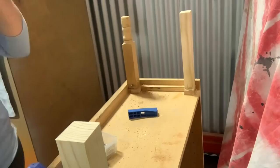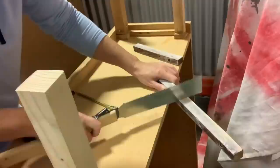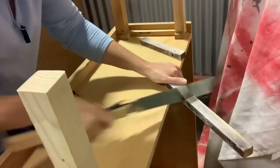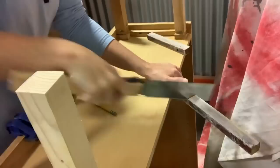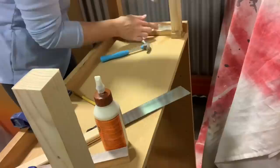We're going to add a little bit more support here. With my extra strips of wood — you can buy these at Home Depot, and they're very inexpensive and just nice to have on hand. I'm cutting these to add more surface area to glue on and also to give a little more bracing between the two legs. You can see I changed up my glue — for no other reason than I just used up the last of my Titebond.